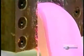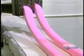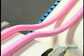The mixture's ready when it reaches the consistency of bread dough. They transfer it by cart to a machine called the pre-extruder. The machine squeezes the mixture through a narrow opening, like squeezing toothpaste from the tube. This transforms the big, bulky wad into thin, manageable strips that can then go through the extruders.